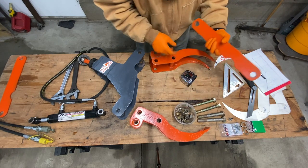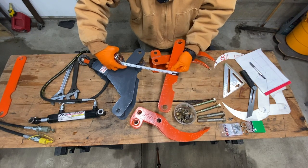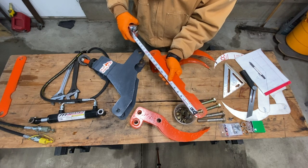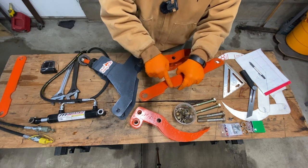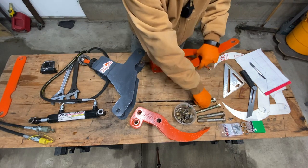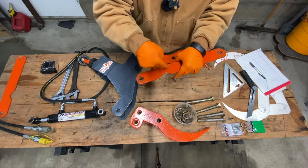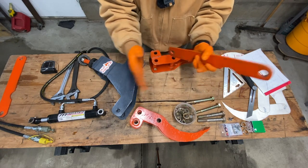These pivot pieces are just over 2 1⁄4 and 16 3⁄4 in length. Hole to hole looks like 14 3⁄4. And these notches — once you put it together, you'll see where the bolts come close. I just took a washer and cut a notch out so the jaws can close a little bit more.